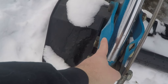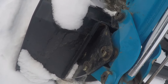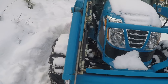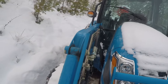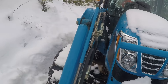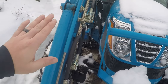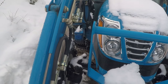You can see here that these brackets are bent — all chewed up and bent up. They're not touching the cylinder, so I'm not too horribly worried about it. That happened when I was using the tine bucket doing some stuff with this tractor that I probably shouldn't be doing. I just ground the top off to a point. My thought process is this tube got filled up with snow and ice, and that's how it got bent up. It couldn't push it out, so I'm hoping that at a steep angle point, if that ever happens again, it can chisel it out as I curl the bucket instead of bending this rod.